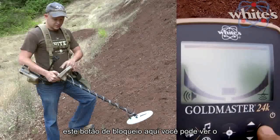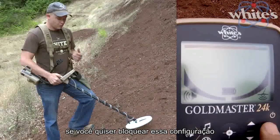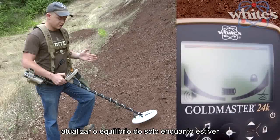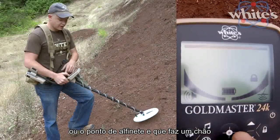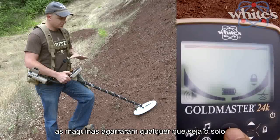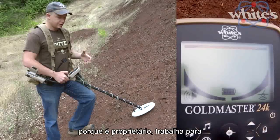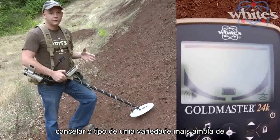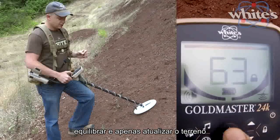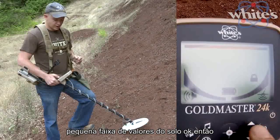The lock button: you can see the arrows jumping up and down because this is operating in XGB — the automatic ground balance setting. If you tap that lock, the lock icon comes up and you're locked. If you wanted to update the ground balance while locked, just tap the bullseye/pinpoint button and that does a ground grab. XGB works to cancel out a wider variety of ground minerals, but if you're hunting tiny specks of gold, it's smart to lock the ground balance and update it manually often.